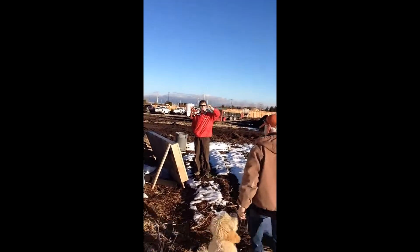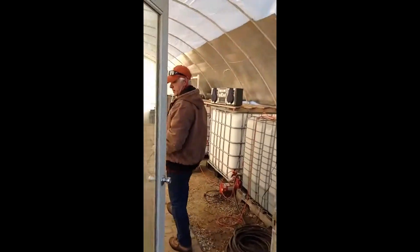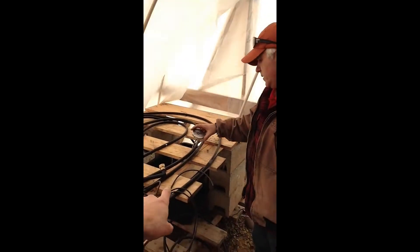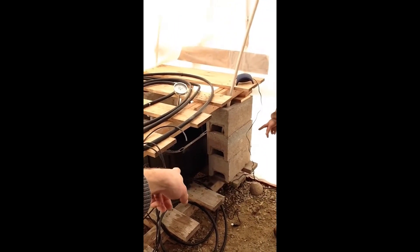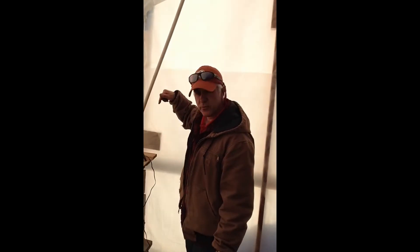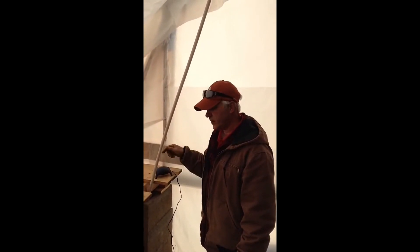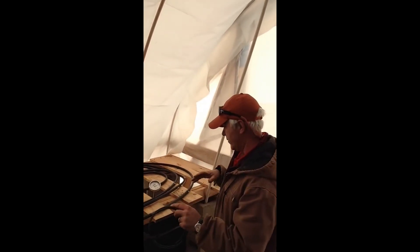Oh look, there's our operations guru Michael Addis — you're gonna be a star Michael! Hello kids at home! So the pipe runs in through the high tunnel plastic and comes into this tank. It coils through the pile around a wire mesh, coils through that, comes through the plastic into this tank, into a pump, circulates through the bench, and then back out again. This reservoir just acts as a place to catch all of that and make the circulation happen. We've got the water up to about 70 degrees — a 70-degree heated bench in a high tunnel, outside in the middle of January on a 36-degree day. Not bad!